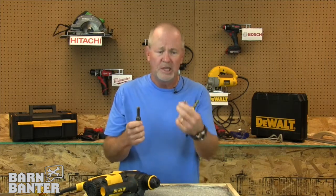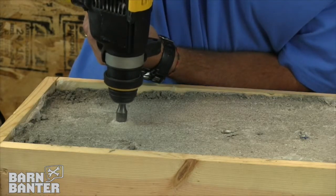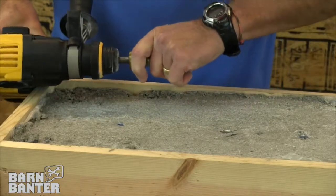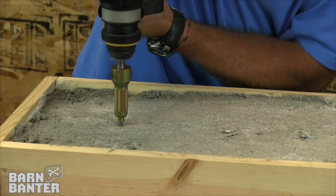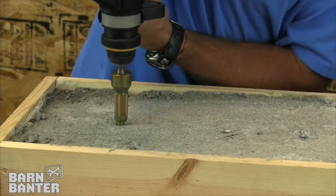It comes with a series of bits of different sizes and a series of setting tools that are different sizes, and of course anchors that are different sizes. Basically what you do is you put this in a rotary hammer and you drill your hole — it's a predetermined depth. You drill the hole, put the setting tool on over it, and it just twists on and locks in place, and then you use the rotary hammer and this combination of tools to hammer down onto the anchor.